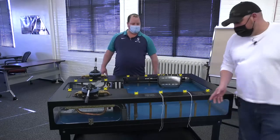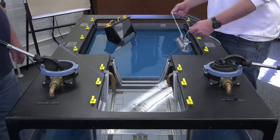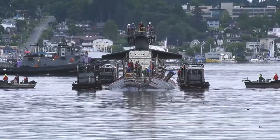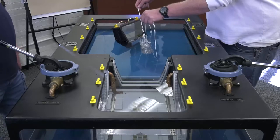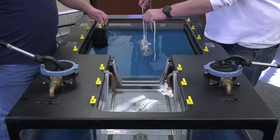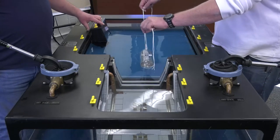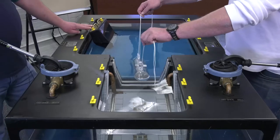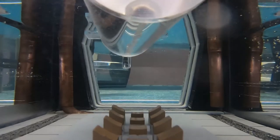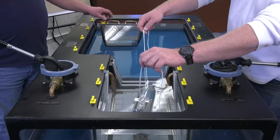After that, we go to the boat. We take the boat off the pier and use little tugboats to push it out. At this point, Theron's guys use scopes — like a telescope with a crosshair — to monitor where the ship is sitting. We slowly bring it into the dry dock, get it centered over the blocks, and use those scopes to verify position. Then we tie the ship in place and reinstall the caisson.